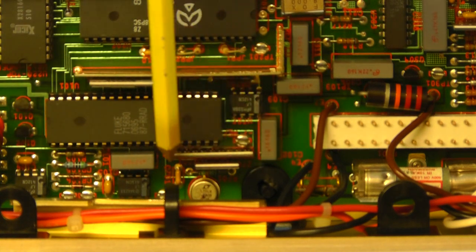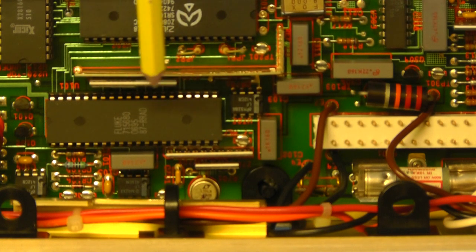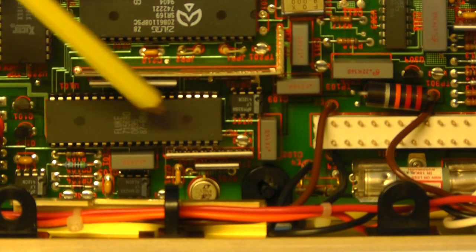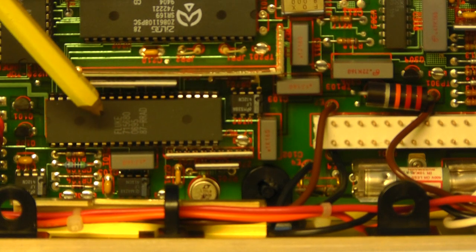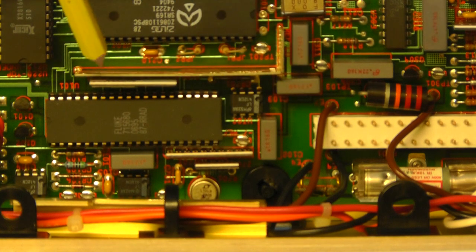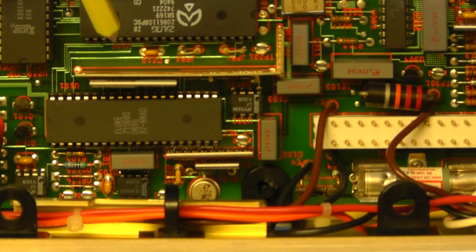There again you can see these thin film resistor networks, which are specifically made for Fluke, and very little else here apart from this large logic IC we have here. Again, that's a Fluke part number on that. What they've also done in this area is put some metal shielding, shielding the reference supply circuitry here from the microprocessor and the switching logic at this side of the board.